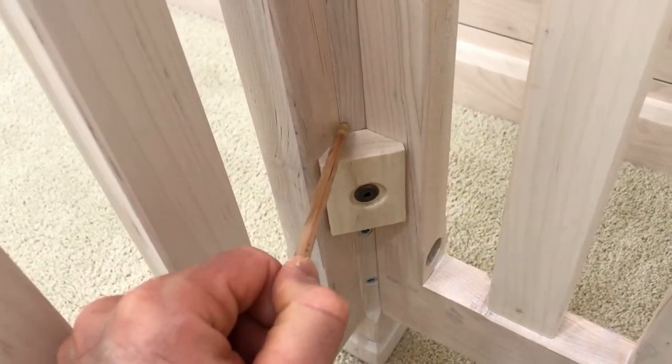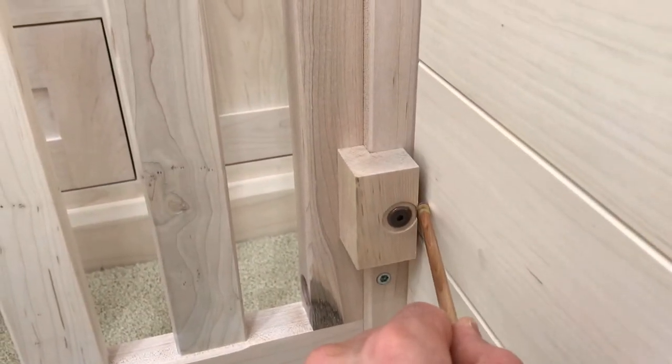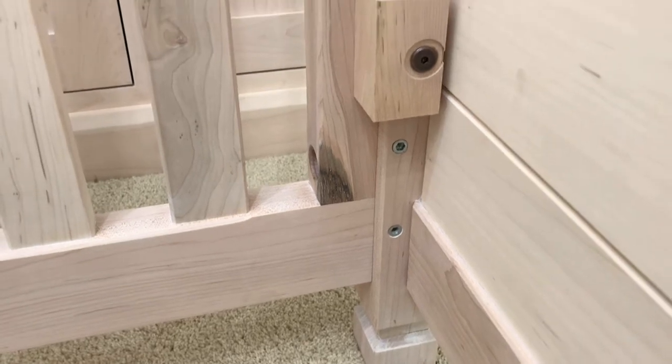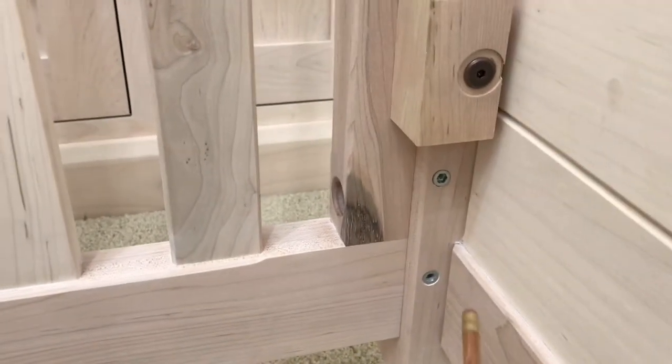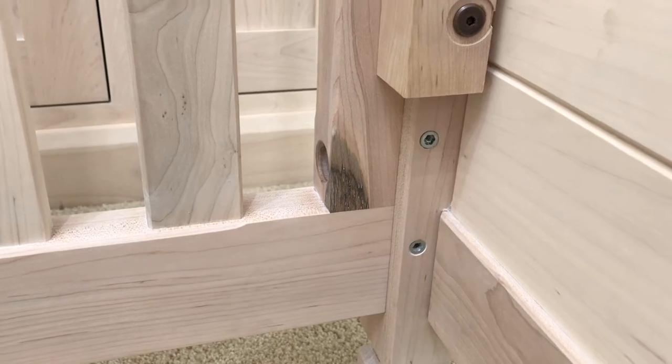And on the inside edge here, this was obviously a very sharp corner. So this serves two purposes. I put a very heavy chamfer on that, and it eliminates that really sharp edge, because almost all of this will be exposed. So it eliminates that sharp edge for the little man. And then it also gives me a flat surface to insert my threaded inserts and to get this block matched up against. And then on the back here, this has to have this gap, because when it's on the lowest setting, this part of the headboard is inset 1/4 inch from this part of the headboard. So that's why there's this 1/4 inch gap. And these threaded inserts here on the back are just centered 1/2 inch off the front edge.